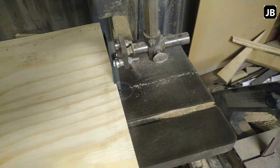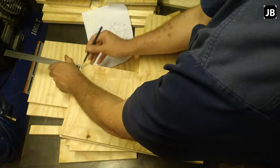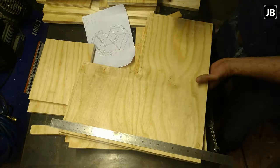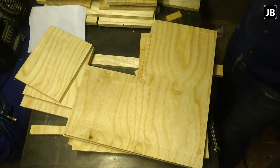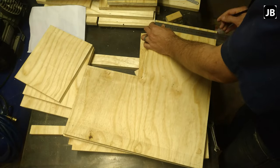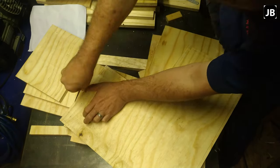Next step: marking out the screw lines. I set my combination square to half the thickness of the shutter ply and started drawing them out so we know which lines to follow. I've also kept the screw edges away from the edge — longer than the screw is long — to make sure you don't drive one screw into another, and dividing the ends in half to make sure everything is covered.